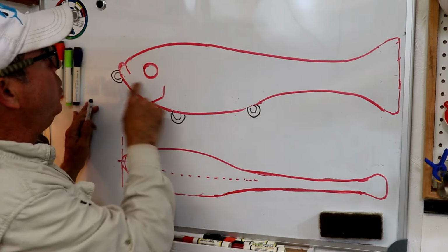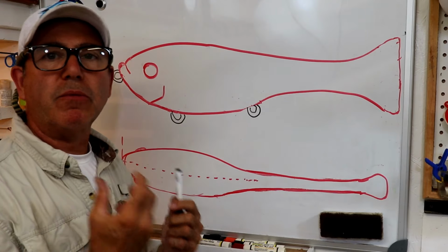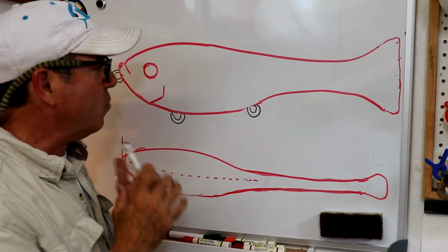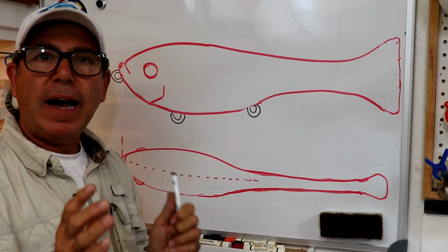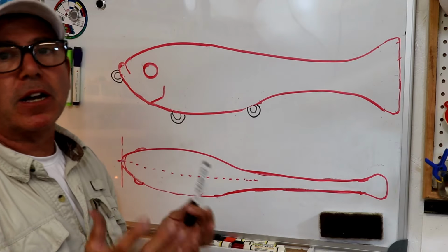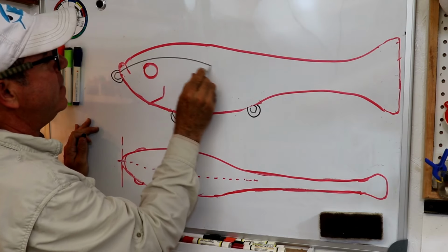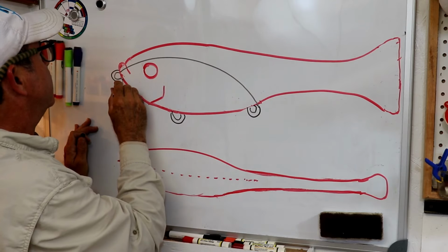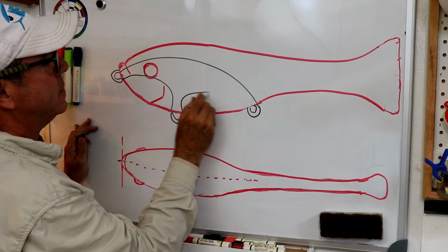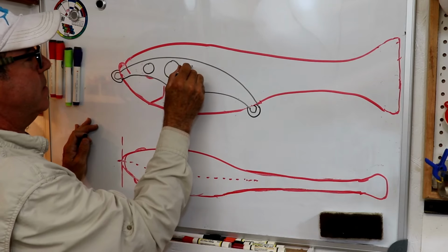Now, if I were to use a regular truss on something this big, the wire would have to be really thick to make any real difference in how rigid it was. So I really was thinking about, how am I going to do this? So my solution was, instead of a truss, to make a girder. And so it'll look something like this. And it'll have lightning holes in it.